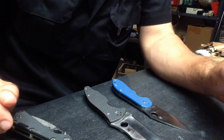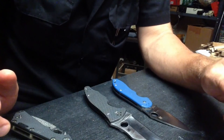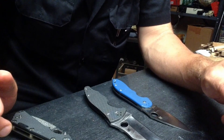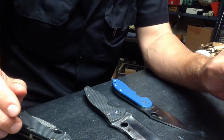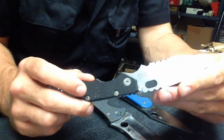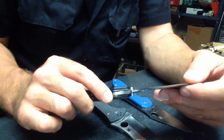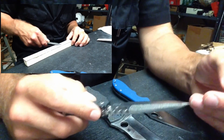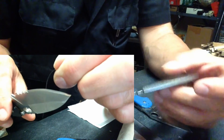Throughout this testing process, I was talking with Cliff Stamp. We were having conversations about the tests, the steels, and different aspects of it. When all was said and done, I shot the results over to him. He said what would be interesting is if I re-ran the test with ATS-34, or a steel in that range. This is a Buck Strider collaboration in ATS-34, heat treated by Paul Boss. I reprofiled the edge to 30 degrees inclusive, then sharpened it freehand from coarse diamond out to ultra fine, and then stropped it to 0.1 micron diamond compound at 50% concentration — 200,000 grit.